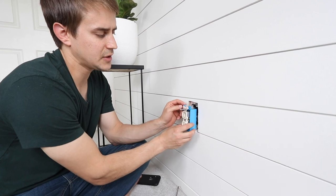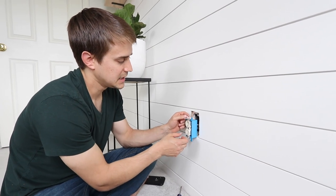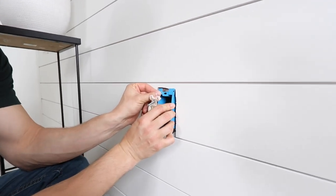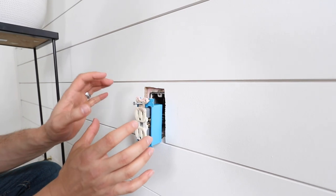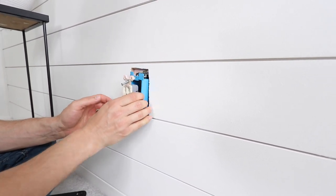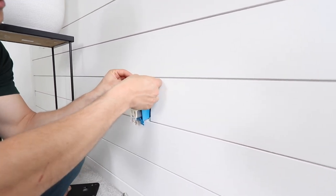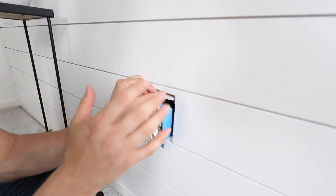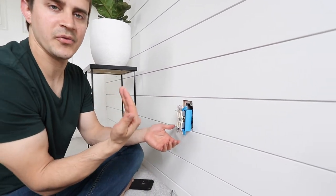With this being a thicker product, I felt like the extender would work better than spacers. One thing I didn't account for is that these pieces have to sit flush against the new finished wall — because I cut enough room to give myself space to work, there's nothing for them to sit against and they could pull back flush to where they were originally. So I cut a little piece to use as a spacer so it has something to rest against. Once you add the faceplate, that'll tighten things up forward as well.